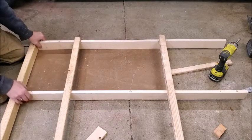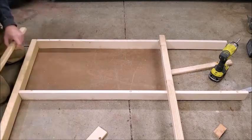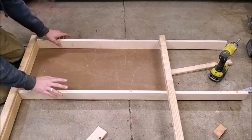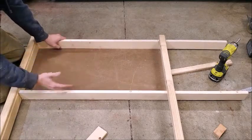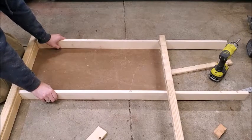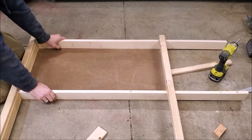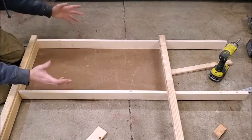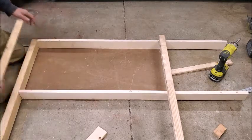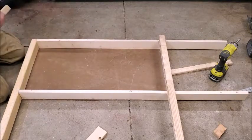I think at this point I'll utilize it at the bottom, and then as you just saw, I ended up ripping a 1x6, so I split it in half. It's actually 5.5 inches it measures out, so ripping it down the center, 2 3/4 works out beautifully. So I got the sides which match this bottom piece, so it's now all that 2 3/4 depth.